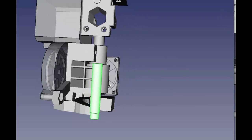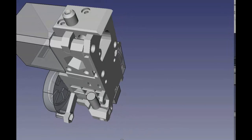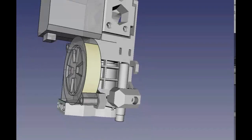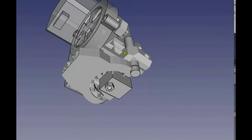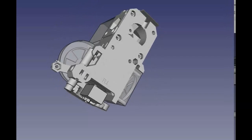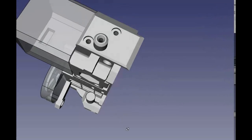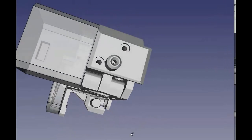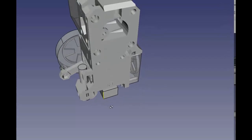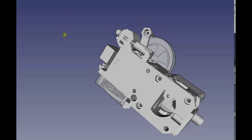So let's see, how easy is it to modify that holder? Let me look at the extruder body. Do we have enough meat around there to accept a slightly bigger probe? We need 8mm more. I think the larger sensor has 18 millimeters diameter. That wouldn't fit in the current design then? Do we have 8 more millimeters there or no? Can we expand that hole?